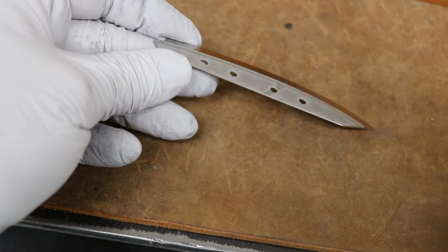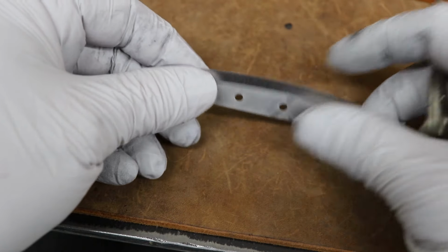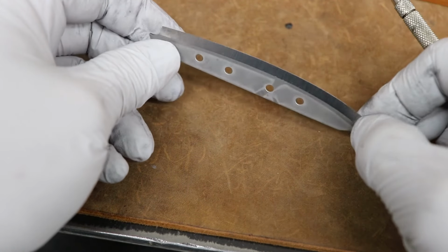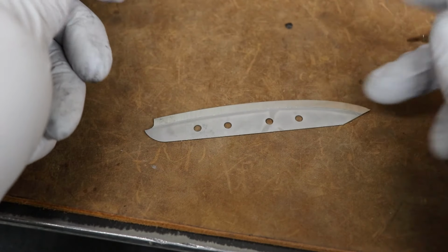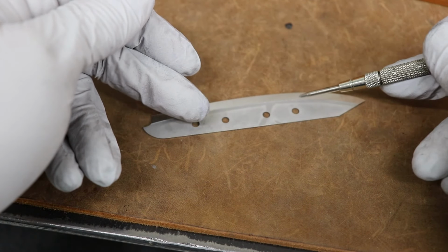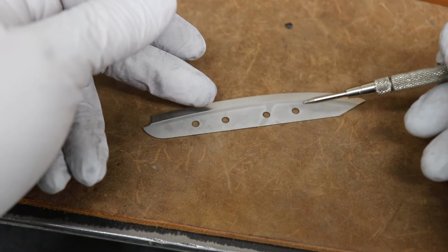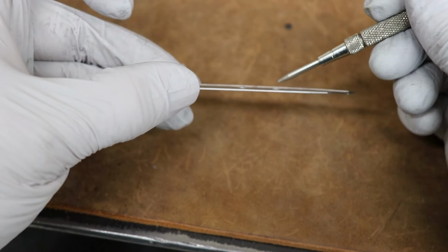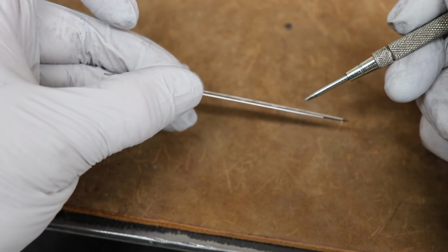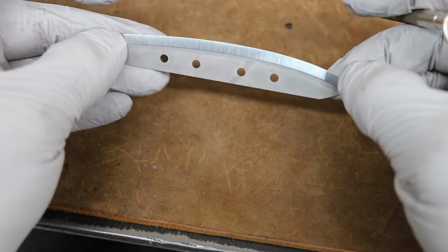Oh, I wanted to tell you about this little step that I put in here. The reason that I have that: you could just leave this as a core and bond the composite to the outside of it. But what you end up getting on the composite is a knife edge. And that can lead to it starting to lift the composite, especially if it's that thin. It's got almost no structure to it, or it's just resin at the edge, and that's no good. So leaving that little step there ensures that I have at least one or two layers as a structure rather than just a zero edge. Having that thickness of carbon there will keep it from peeling up. Should hold together nicely.